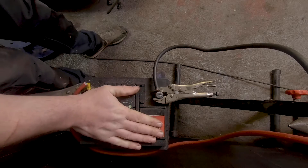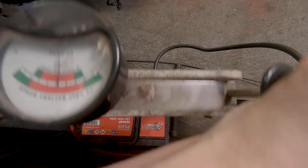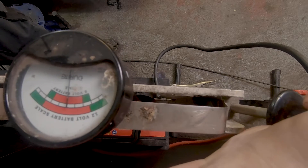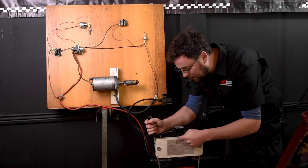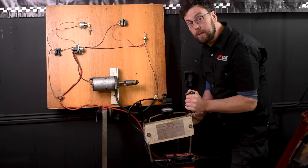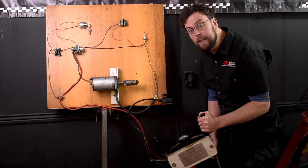How do we test the battery? Here's the battery of our test board — you can see the positive and negative coming down onto our battery panels, the same as you would see in your car. We put the high rate discharge tester across the terminals; this leg is adjustable and moves in and out. When you bring it down on the battery you're looking at the dial to see what rating you get. You hold it on the battery for about eight to ten seconds to see if it maintains the green. You can see a little bit of smoke — that's the high current burning off any oils or greases on the element inside; it's quite hot so be careful. If it remains in the green then there's probably good current capacity in your battery. If it's in the red, that's the very first thing you need to fix before moving on.